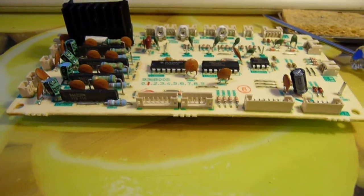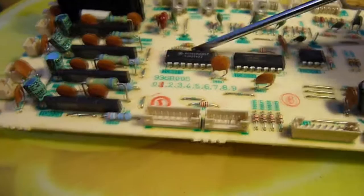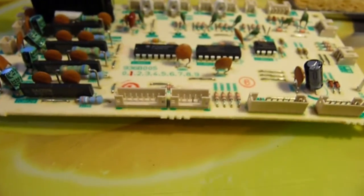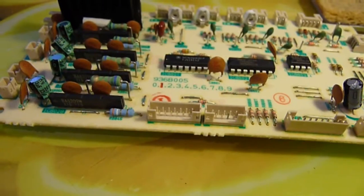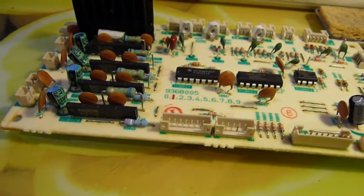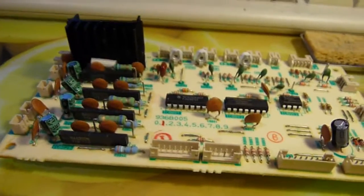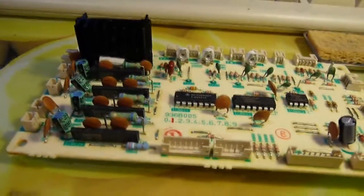Oh yeah, this is a Hex Inverter. This one is... forgot about this one. This one is a Hex Inverter. That means it's basically got 6 NOT gates in it. To sum it up nice and simple. And this one's the motor driver, which can do, there we go, the applications. VCRs, cassette tape recorders, you know, usual things. Power transistors can handle large current, 1.6 amp maximally.